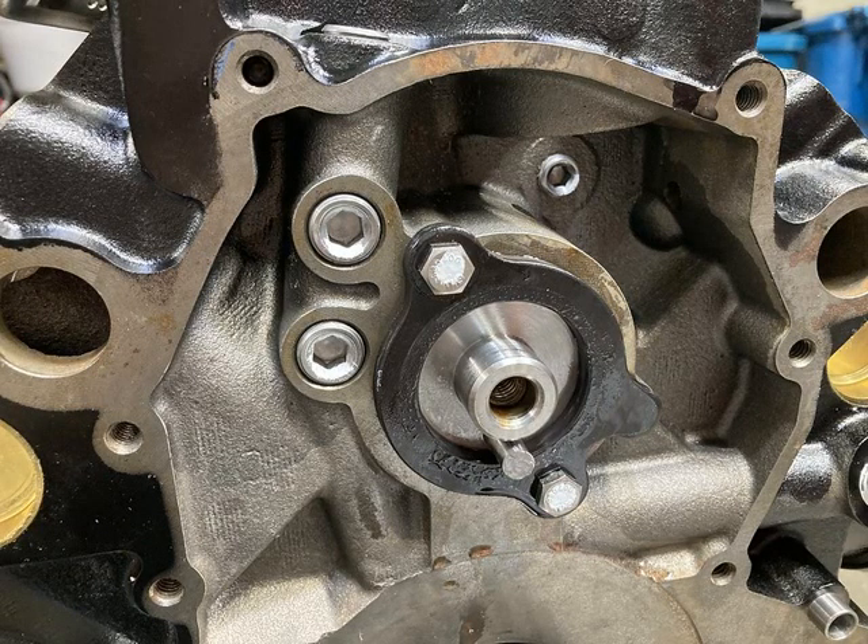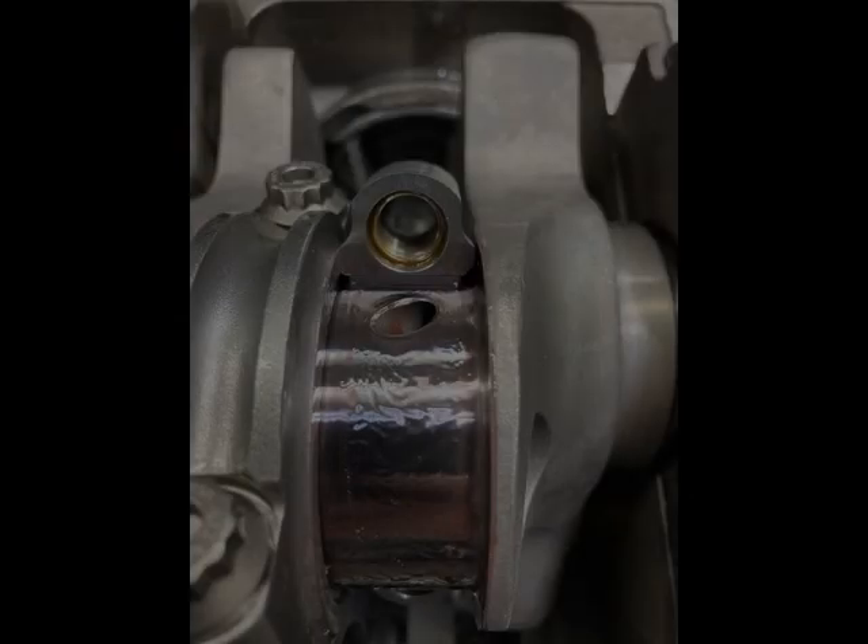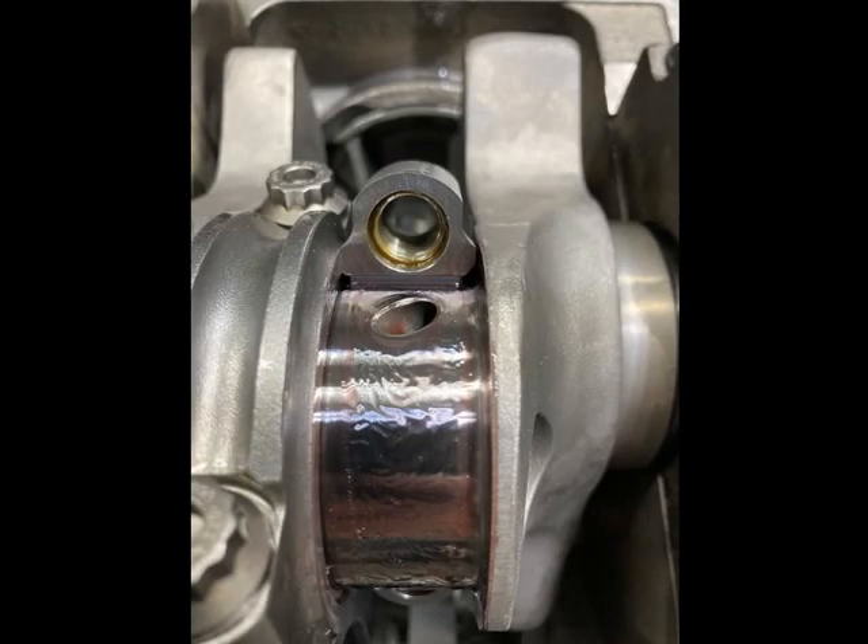For the front end, if it's a steel cam I always use a steel thrust plate. We have a new steel thrust plate shown here, and when I torque fasteners I always put a dab of paint on it to quell my OCD. Here we're checking piston-to-valve clearances using clay so I can get a good idea of the radial clearance on the valve and the valve relief. We had plenty on all counts - both depth and radial clearances. We also took a shot looking at how the rod bearings align against the shoulders of the rod journals of the crank.